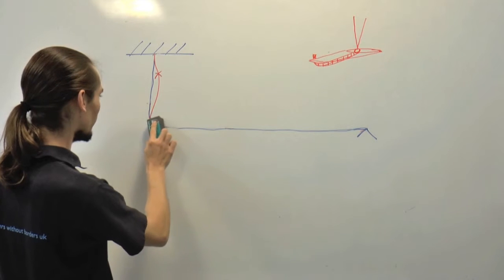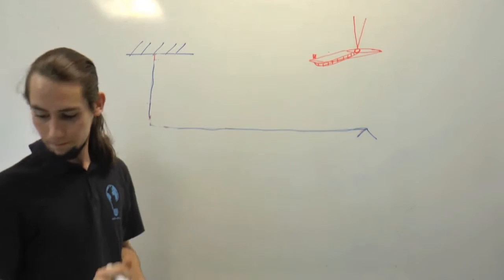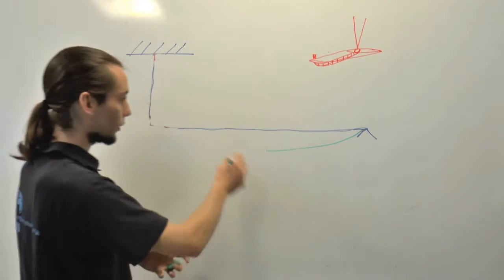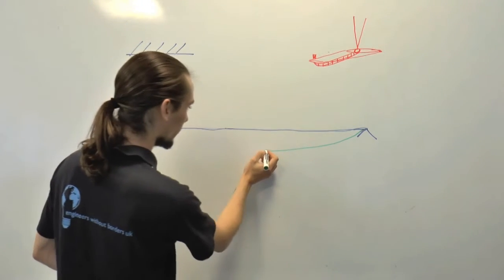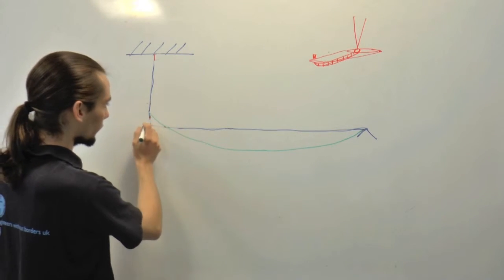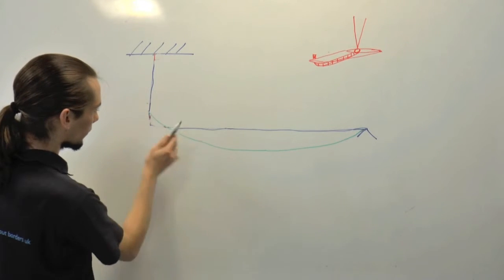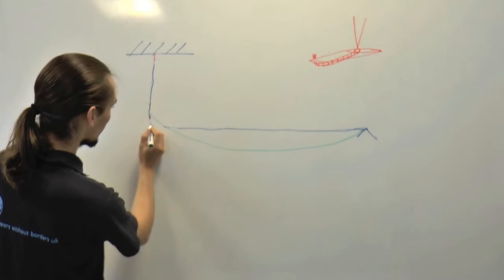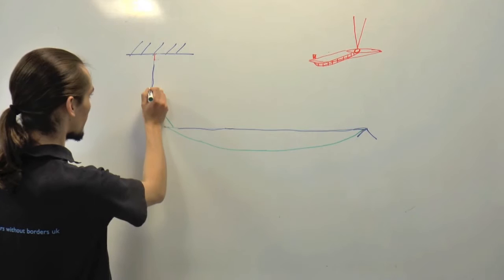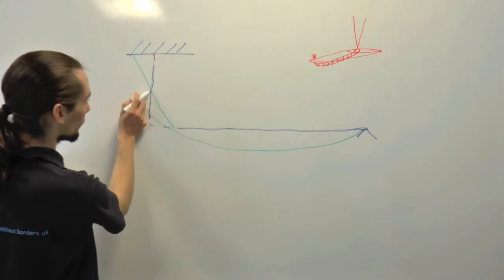and we can use that information to draw in a qualitative bending moment diagram. Let's hopefully get it right. So start off with this sagging moment caused by the load, the uniformly distributed load. Going to end up with a bit of hogging here, and then that's going to transfer around the corner, so around this way onto here. So this now corresponds to the bending at this point. And going to go up. You notice we've got zero moment where we had those points of contraflexion from before.